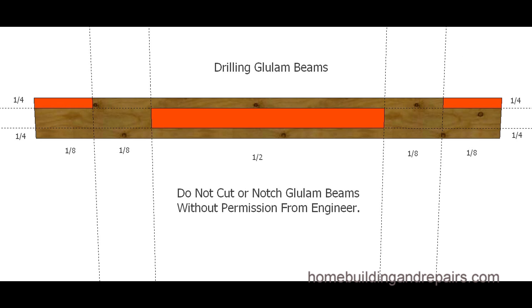If you are not comfortable, do not do it. I've only seen it done once and it shut the job down — I've never seen it done again. If you haven't cut the beam or drilled a hole, do not do it. If an engineer gives you permission, make sure you have enough paperwork to back it up, because these beams aren't easy to replace — they're designed for quite heavy loads.